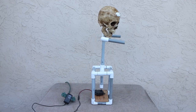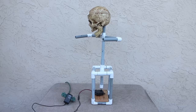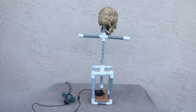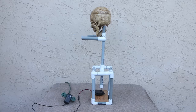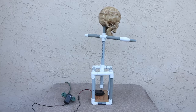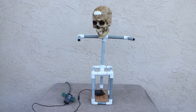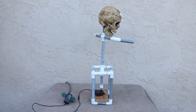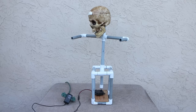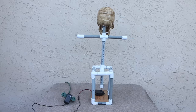This first prop is one of the most simple to construct — it simply rotates around. I usually run it on a controller so it'll run for a little bit, pause, let the motor recover, and run again. When looking for a motor that runs full time, make sure it's rated for continuous motion — wiper motors are certainly designed for that. I attached the PVC with a cap and a quarter-inch bolt that threads directly into the shaft of the vent motor, then soldered in a little two-prong connector for easy swapping.